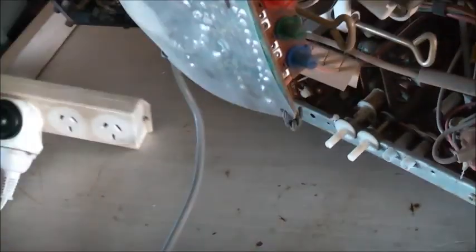Promising so far. Unplug, safety first, nothing's been stressed. I think I've done some reforming. The amp meter didn't even twitch, so I think this is safe to proceed at full mains. Look at that, dancing around the static. Yeah, I've got the heaters on now. Now we're going to get something.